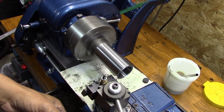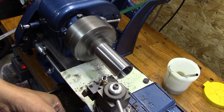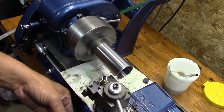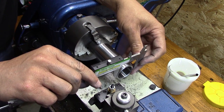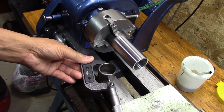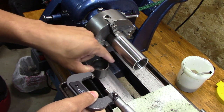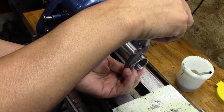So I took a YouTube trick where you just take the first quarter or eighth of an inch and dial in your last cut. Once I cut in just barely touching it — cause that's all it would take off, about a thousandth — I measured it and it looked good. So I ran it down and then pulled out the mic, tested the old one, then measured the new one. Lo and behold, I got lucky on this. It was spot on.